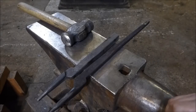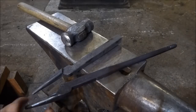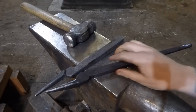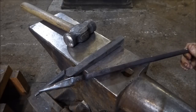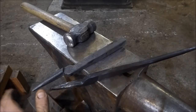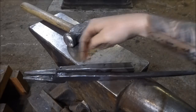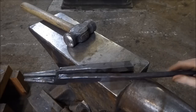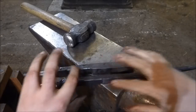This video is becoming quite long — drawing out is quite a laborious process. I think this was about ten heats. With the talking, turning the fire off and sorting the camera out, it took me about 20 to 25 minutes to draw that out. It takes a long time to draw stuff out. The point I'm making is that's drawn out — it's reasonably good to where I want it. It's pretty much how I'd expect my tongs to look. It's a bit lumpy bumpy because I'm not spending the time tidying it up just yet. This is where we were before, and this is what we are now — it's pretty much doubled in length. This is a reasonable set of tongs; if you wanted to leave the reins like that you could probably get away with it. I think this end is a bit thick — when I come to adjust everything up there I'm going to take a little bit more length out.